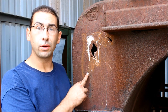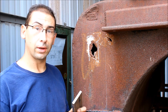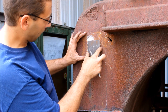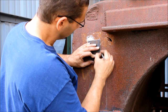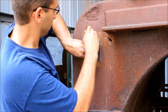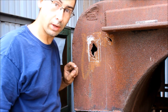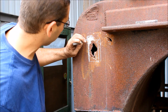We have this hole right here in the tank that we have to fix. I'm going to cut this out, and then I have a piece of 5/16th inch plate that I made. I'll stick it in place, flush weld it, grind it, and you probably won't notice it. The first thing I want to do is match up where I want it to go, mark around here — that gives me the basic size. When I use the torch to cut that out it may burn that mark off, so you have to mark it with something that won't burn off.